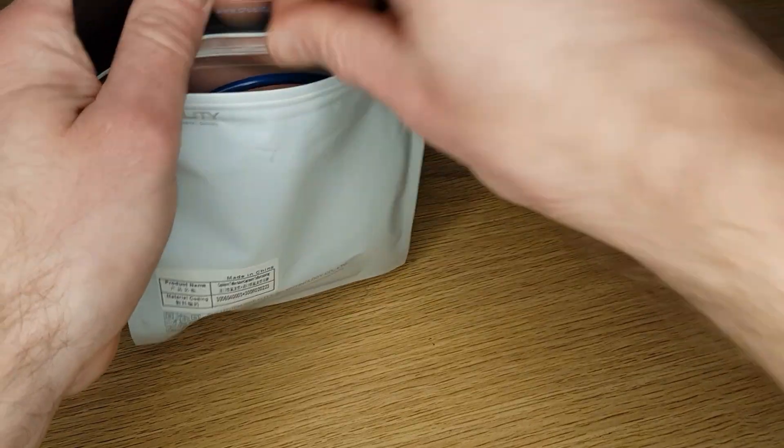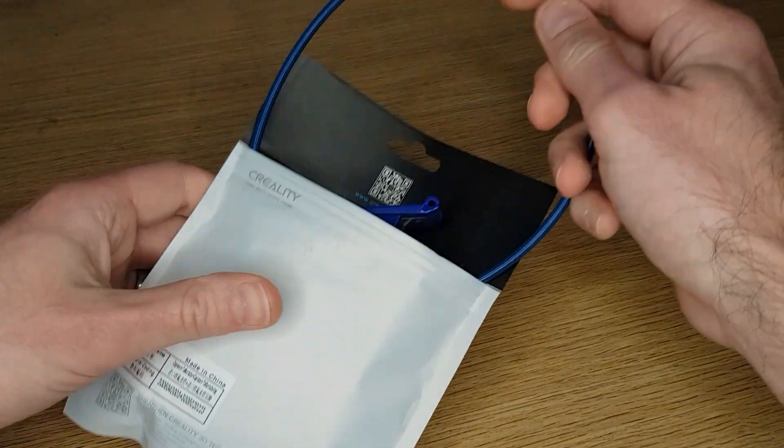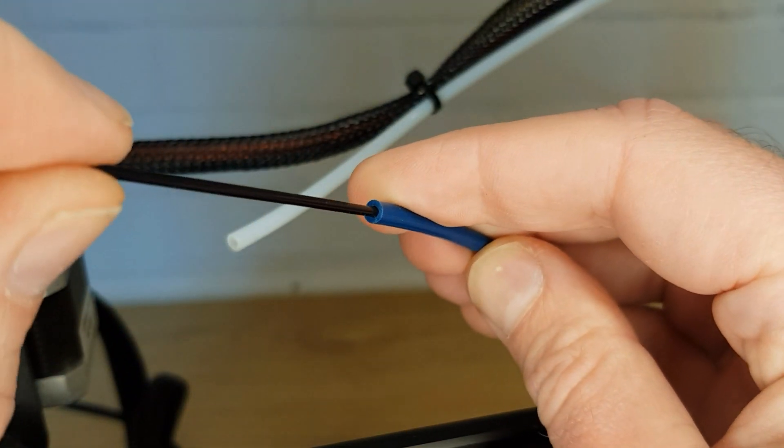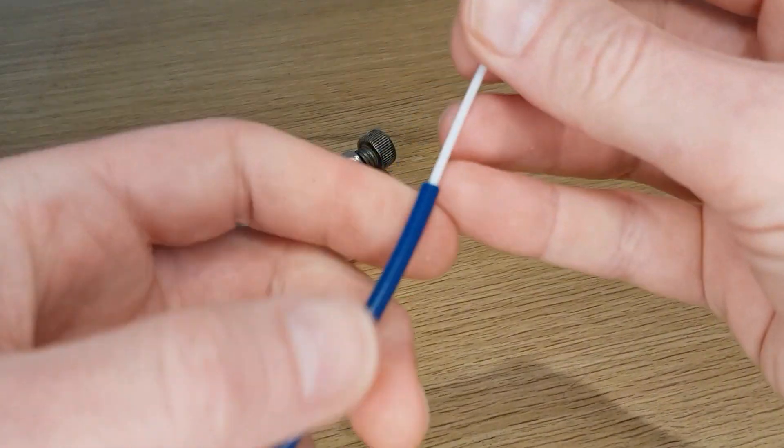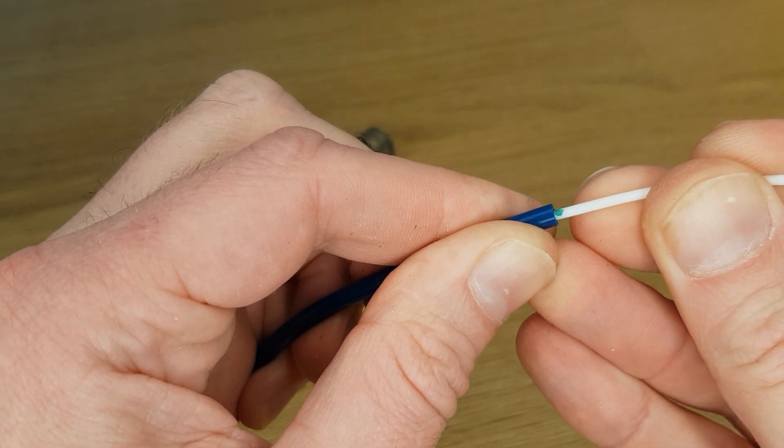This quick test shows that with one end of the filament fixed, I was able to move the other end by 3mm. That directly translates to 3mm of extra retraction distance you'll need over a setup with no movement. This is where an upgraded Bowden tube wins. This XS series Capricorn tubing is specifically designed for 3D printing with a smaller 1.9mm internal diameter. It tolerates nozzle temperatures up to 260 degrees and has lower friction with your filament due to a secret high performance additive mix. There's a link in the description to the exact item I bought. Performing the same movement test on Capricorn tubing, we can clearly see the difference — there's now only 1mm.